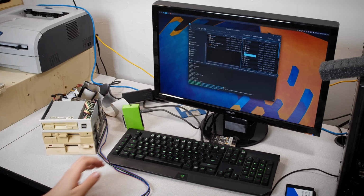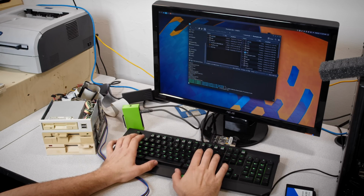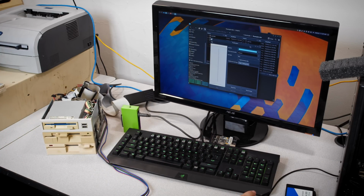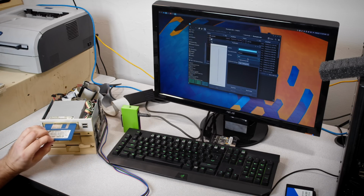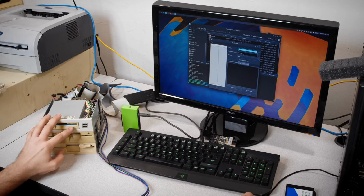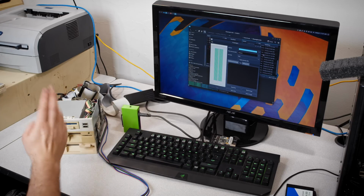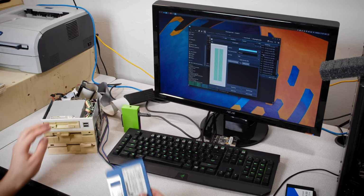there we are. I can launch the Flux Engine GUI. All right, and if we did drive 0 there, I can go ahead and put a disk in here, and we can image that. What was this for? That is for the IBM. Perfect. Drive 0, that is not a high density disk. And we will read Flux. It will select that. So there we have a successful read on the 3 1/2 inch drive of, ooh, exciting, easy working resume creator.